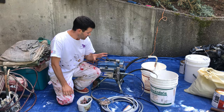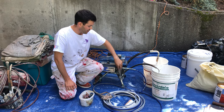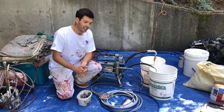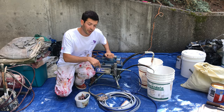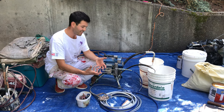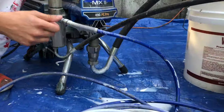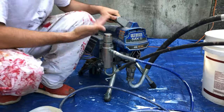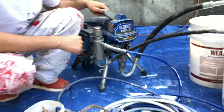Pretty much in a nutshell, that is the machine. You want to clean it every time you're done with it, wrap it, and keep it in clean working order so all the parts aren't covered in paint and you can actually pull them apart. When you're done for the season in the winter, there are products you can buy like pump armor, or you could leave paint thinner through the hose so it doesn't freeze for those in cold climates — so the ball and everything inside doesn't get stuck. Also, right here inside the pump there's a product called throat seal — you stick it inside to lubricate the pistons, so as the pump bumps up and down, it gets rid of any debris or paint that sticks on there. Really important to keep that clean and free of debris.